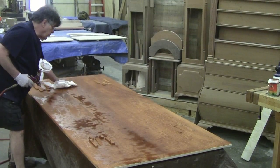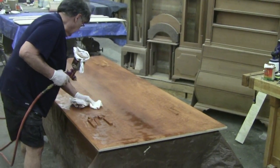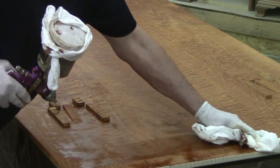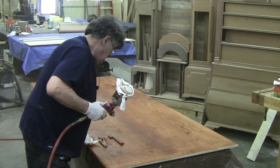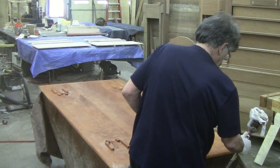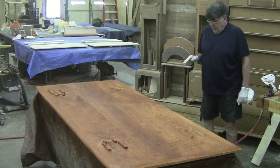You can see on the other side just how quick it's drying. The one thing you're going to notice is that a dye, when it dries, has no luster, no sheen, so it looks really dead and dull. But your top coat is what will bring it back. And that, guys, is how you get a dye on even and fast. Again, when it's wet, it's what it's going to look like when you put your top coat on it.